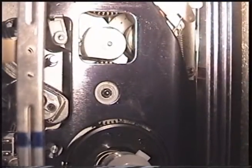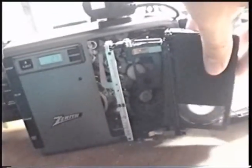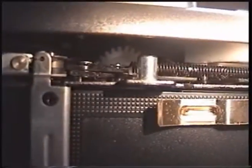Regarding the battery pack — I've had this thing turned on continuously testing it for three hours and the battery is still holding up. I measured the voltage and it's only dropped by about half a volt, so that's awesome. I'll eject the tape, stick the cassette in — I guess this is a two-in-one video now: new battery pack and unexpected camcorder repair. I'll turn my light back on so you can see the gear turning. Press play... and it's spinning and playing just fine.